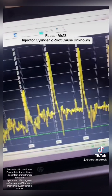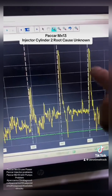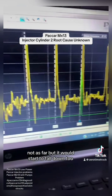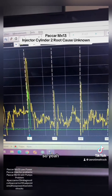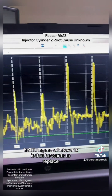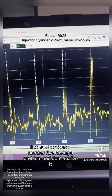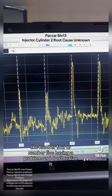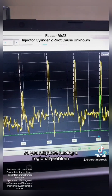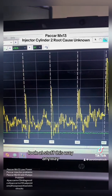As you can see, it's not just six and two — four is affected as well, and if I had stayed another 15 minutes, number five would start to fall too. Number five is weak. My recommendation is to replace all six, but you do what you have to do. Numbers four and five having a problem and not realizing it — this is what contributes to excessive soot, DPF problems. That's why it's important to look at this stuff this way. Thanks for watching.